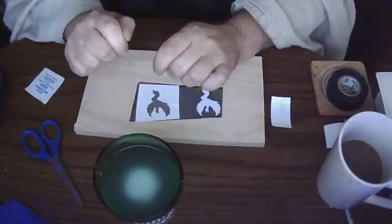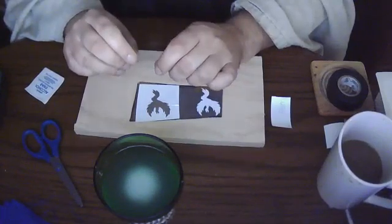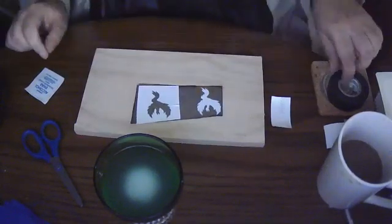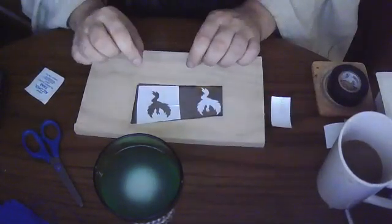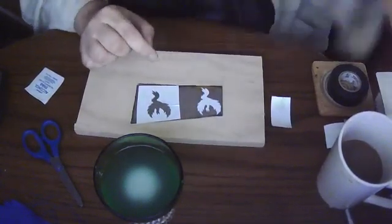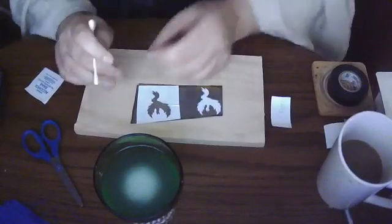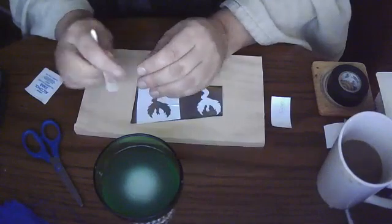Just a little bit off the wires, and what you'll do is you'll take the positive wire and you'll put it onto the metal. Tape it down, and you're going to use some electrical tape to tape it down with, okay? You'll then take the negative, and you'll wrap that wire, the little bit bare wire, around your Q-tip, around the end right here, before you dip it in, okay? Now, you'll have it plugged into your 9-volt battery, and that will allow you to etch.